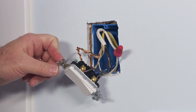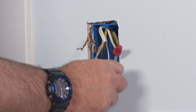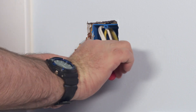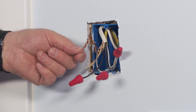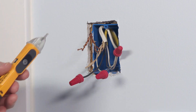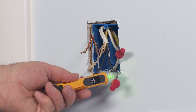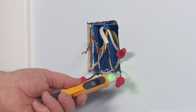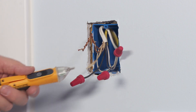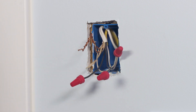With this wiring I can install any kind of smart switch I want. First I remove the old switch. I can safely test by putting wire caps over the bare wires, turning the circuit breaker back on, and using a non-contact line tester. This tool tells me which wire has electricity without touching it. One wire shows green — safe, no electricity — but this other one shows it's live. That's a really good tool to have for this kind of work.